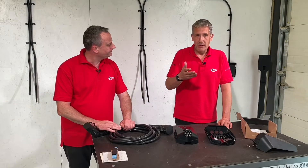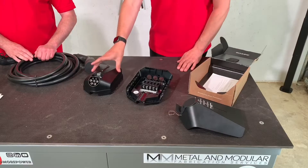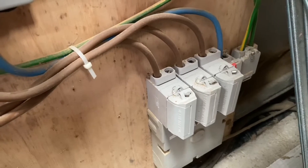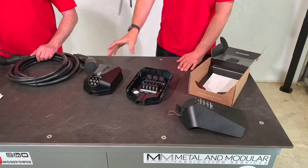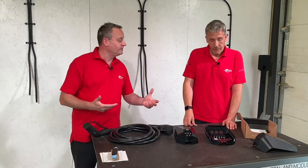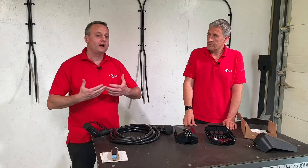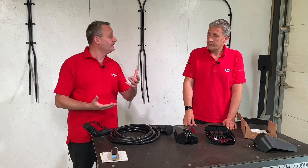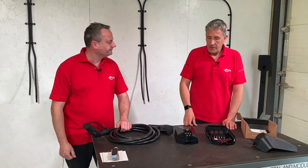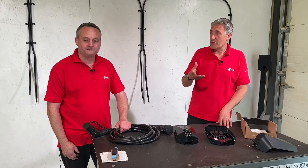People are immediately going to think everyone wants to charge at full power all the time. There's no limit charging at 22 kilowatts from each charger, but the problem in EV charging is how much power the building actually has available — that's where technology like this really works. Let's say there are 40 EV charging points and people turn up for work between eight and nine. They plug in, and they're not necessarily going to fully charge their vehicle — they may have only made a 10-mile journey to work, so strictly speaking you only need 10 miles of energy to get back.